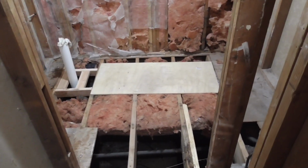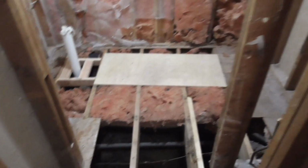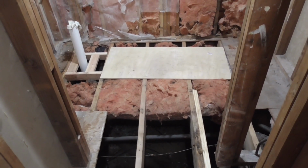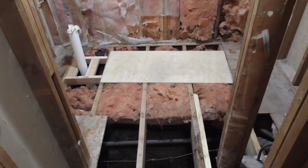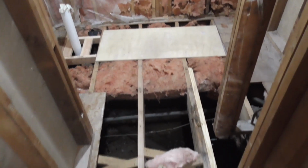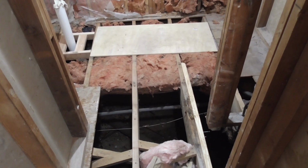So today hopefully we'll get these holes patched up and then add a whole other level of 1/2 inch flooring. And then when I get around to tiling, a 1/2 inch of cement backer board and then the tile, which should give me a lip to the bathroom of about a 1/2 inch above the hardwood floor.